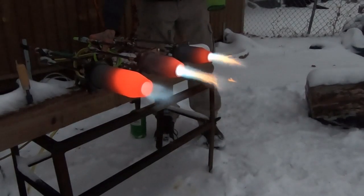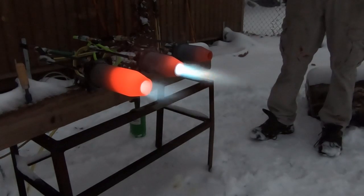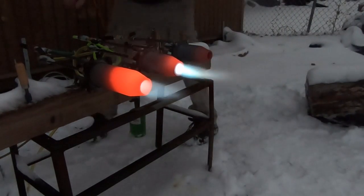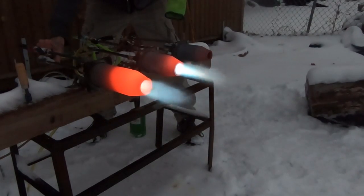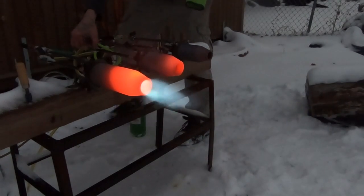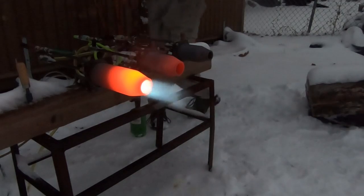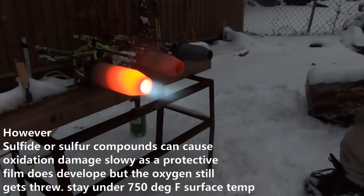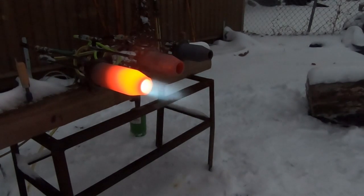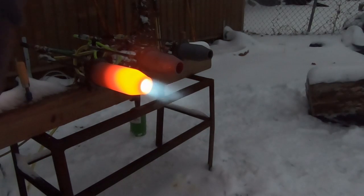High fire mode is when you've got a big old fireball coming off the thing, and when that flame hits that metal, some of the fuel condenses and causes a fluxing activity to take place that washes away the protective oxide layer — and that's how that stuff just seems to burn up so quick. I also got some footage I want to show you guys on a thermal camera of why I suggest we remove those heat shields from the bottom of the boiler. Since we're using these new burners I don't think we have to worry about the direct flame impingement. I recommend you guys take those heat shields and butt them directly up against the bottom of the boiler tank, with a couple of bolts on there loosely enough to allow expansion and contraction.